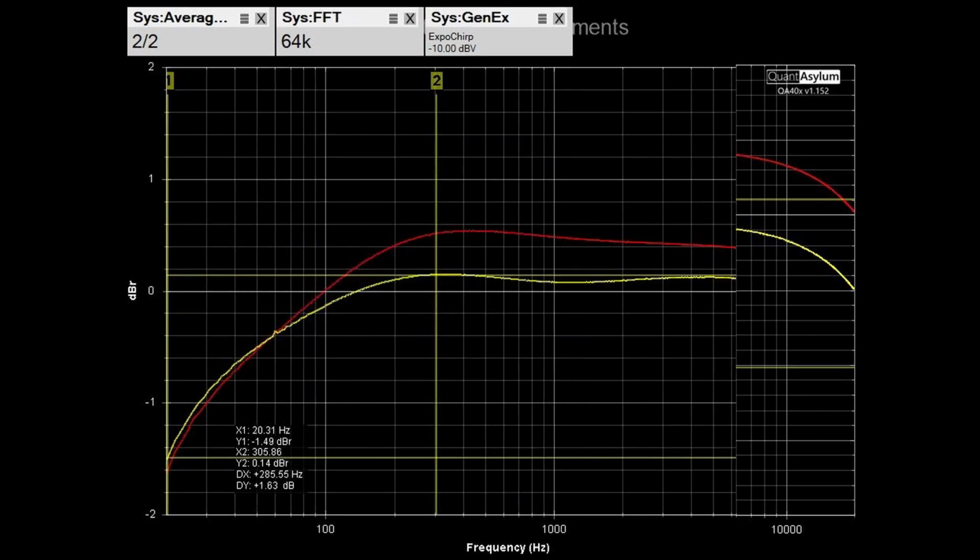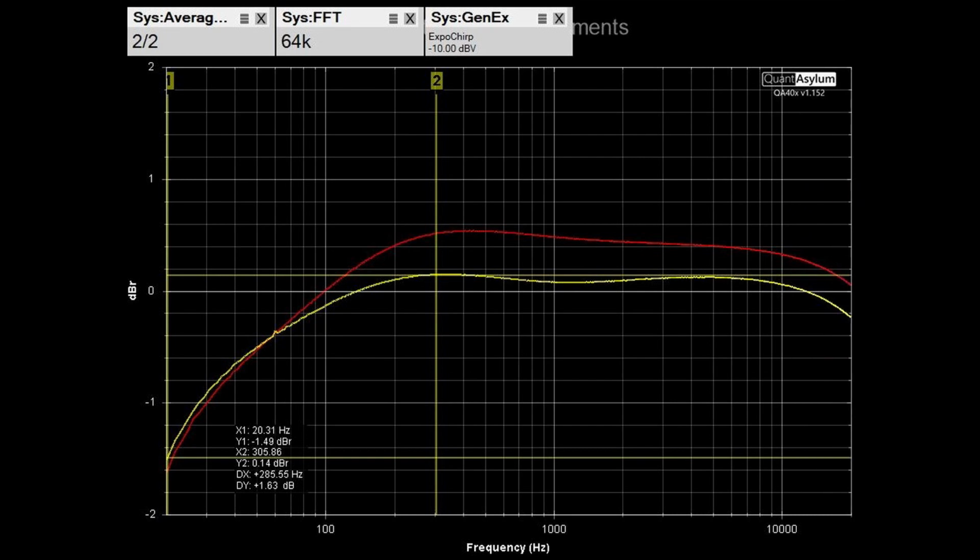The difference between the previous frequency response plot and this one is that the previous one had the tone mode control set to bypass both the bass and treble controls, so it was in the off position. This one has both the treble and the bass controls set for 0, but it has selected the bass and treble mode position and looks about a half a dB worse.